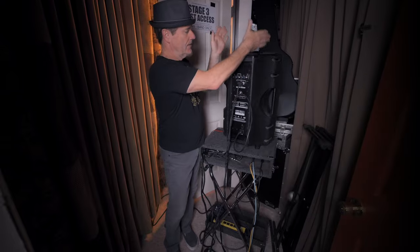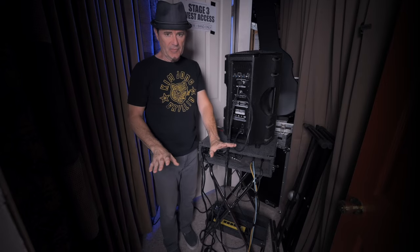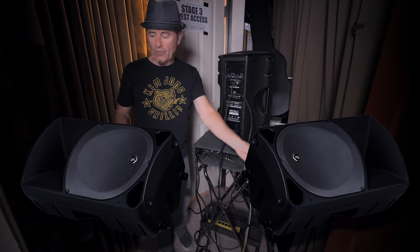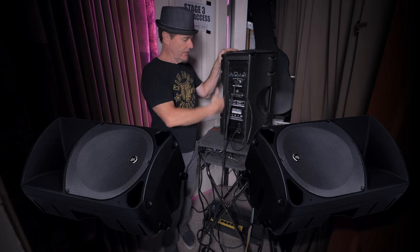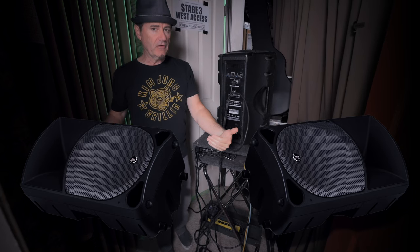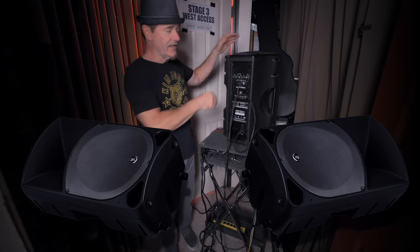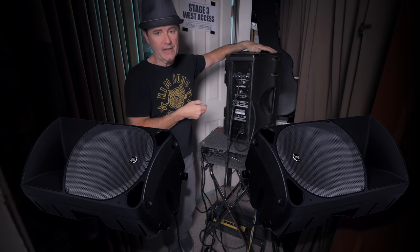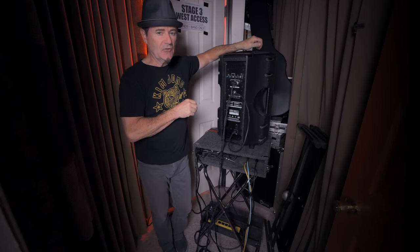The other thing is that these sit the same way on either side. When they're sitting in the vocal monitor position, you can actually have your left and right monitors be true stereo positions. The horn is on the outside of both of the speakers. A lot of these style powered monitors only have the wedge on one side, which means the horn is always on the same side. If you want a true stereo representation, you want the horn on the outside of both of your speakers in that floor position. That's another reason why the Thump is so popular. I'm not sponsored by these guys or anything — they just make a great, super durable product that can definitely keep up with a lot of loud onstage sound and still be incredibly detailed.